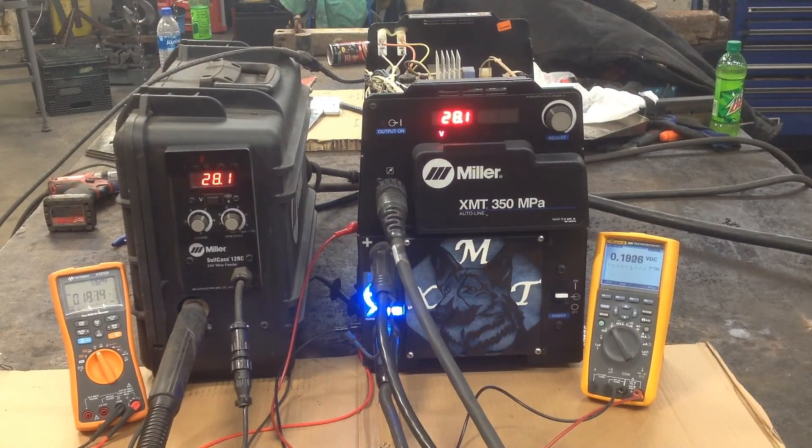As you can see looking at the meters, there is a little bit of improvement. If you want to test it before you do anything, all you need is just some 16 gauge wire or whatever you've got laying around — just a ring terminal to bolt on to the bus bar in the suitcase feeder, and a quick disconnect terminal to connect to that white sense line in the XMT — just run it and see if it improves anything. More details will be in the description below, with a link to the forum post. Eventually we'll get parts and prints posted there, but it's something easy — just a switch and a wire, and that's pretty much it.